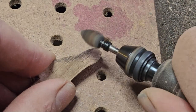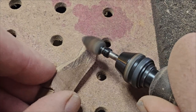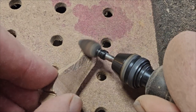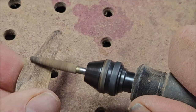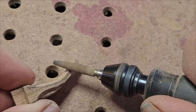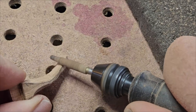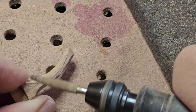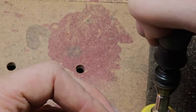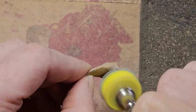What you can also do is brace that fin on the table, so if it does go over the end it's not going to fling back at you. Just really carefully going over it with the flame burr, and now I've changed to the finer taper burr — as you can see it's a lot less aggressive. When you go in the end it's not going to fling around, and even if it did hit your hand it's not going to chew it up that much.